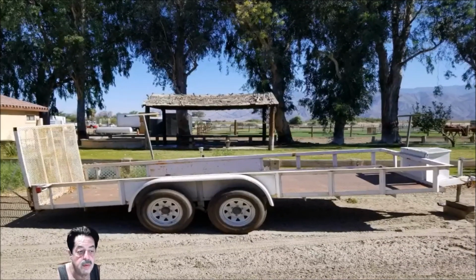Okay, I changed the picture back to this one here, which is what I use for the beginning of the videos, because this shows you the two tires, and these are the ones I had to take off to get to that sheet metal, and you can see in the picture how it comes down and attaches to that angle iron of the frame. So this is where I had to get in there. I had to work with pounding it back the best I could. Kind of hard in some spots, but I used different sized blocks of 2x4, 2x6s, and that rubber mallet. Like I said, I got it all repositioned and I tack welded it, and I weld prepped.